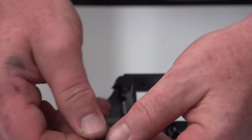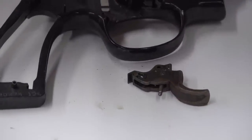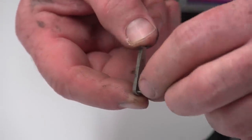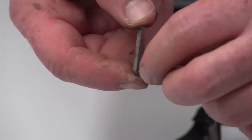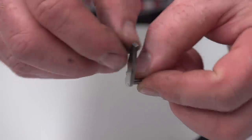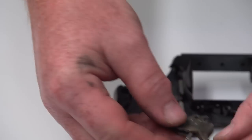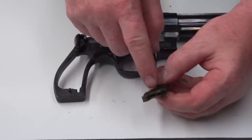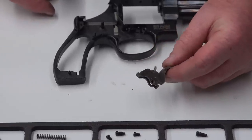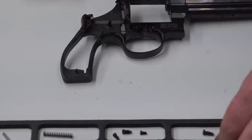To get the hand out, just pull up. There's a small hairspring underneath — it rests on the short stud that comes out of the bottom of the hand. The larger one is your pivot, and the smaller stud is for the torsion spring that keeps the hand forward. As for driving the pins out of the trigger, it's not really recommended unless you have a broken part, because they are in there tightly and can easily be marred.